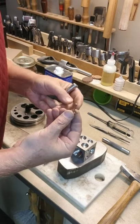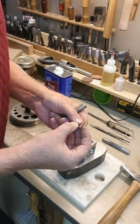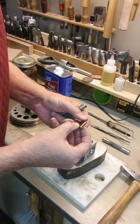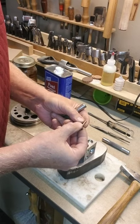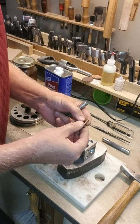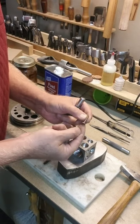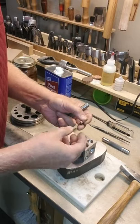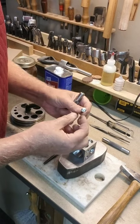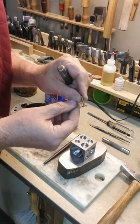There's a good chance that these could end up soft. Although this is holding up pretty well, when you put the washers on you've got to be really careful. I don't think you'd need to drill out the washer — I set that one just fine — but maybe heat up a rivet before you solder onto it and get a feel for how the washers go on. That came out with a perfect dome and you can see what happens on the backside.